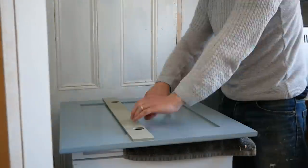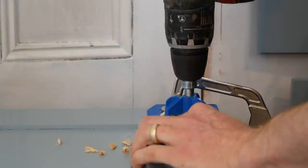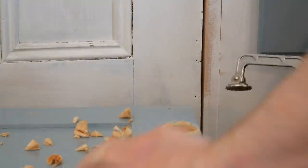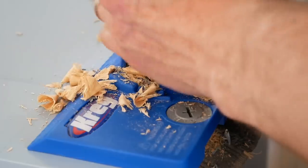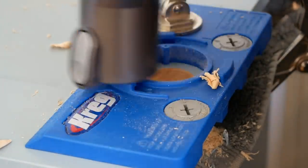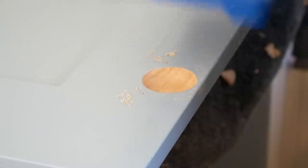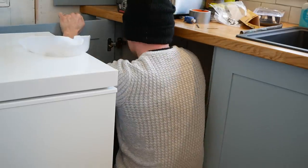Having drilled hinges in both the MDF and these timber frames, I can tell you that it's way, way easier to drill in the hardwood or softwood frames rather than MDF. The shavings are much cleaner, they come out and clear out a lot easier. With the MDF it clogs up, and you really almost need a vacuum sucking as you're drilling throughout the whole process.